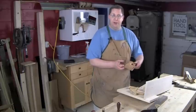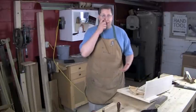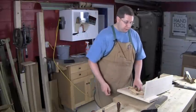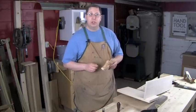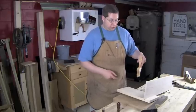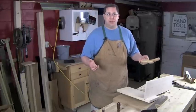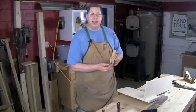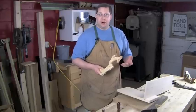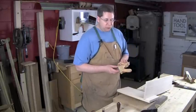You can plane from both sides, but at that point you might as well go back to the saw and router plane. If you're working on a case where you're going to rabbet out the back and put a case back in, you can just plane straight across with the dado plane — it's really fast. But for finer work where this is going to be exposed, this stair saw makes an excellent solution. And for work where you've got to do a lot of these — say a bookshelf with six or eight shelves, that's 32 saw cuts to exact depth — this saw will be awesome for that. And that's again where the stair saw moniker comes from — imagine how many stair treads you're dadoing into the stringers in an average staircase.